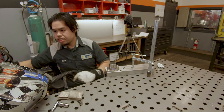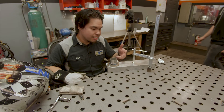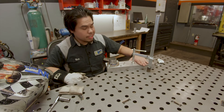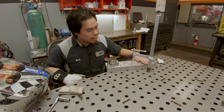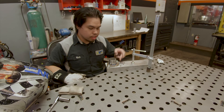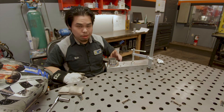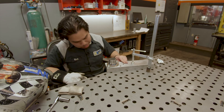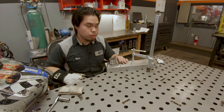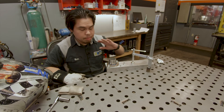Just to see the difference between having a heat sink — obviously you can't feel it because you're on the other side of the computer screen — but this aluminum is pretty hot. I literally just finished welding and I could touch this flange with my hands. It's still pretty warm, but the aluminum heat sink is doing its job. If you didn't have this, the flange will warp a lot. What you could do afterwards is put it on a belt sander to make sure it's flat.